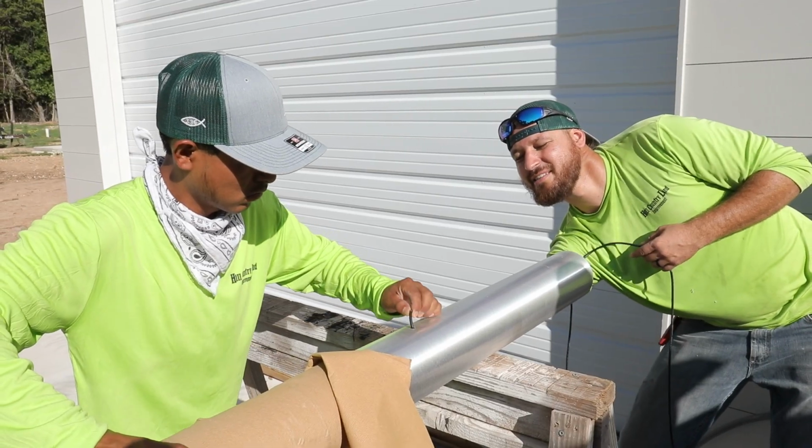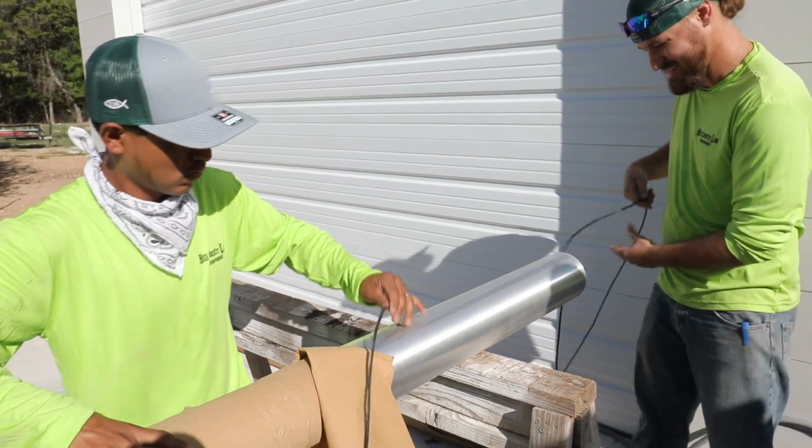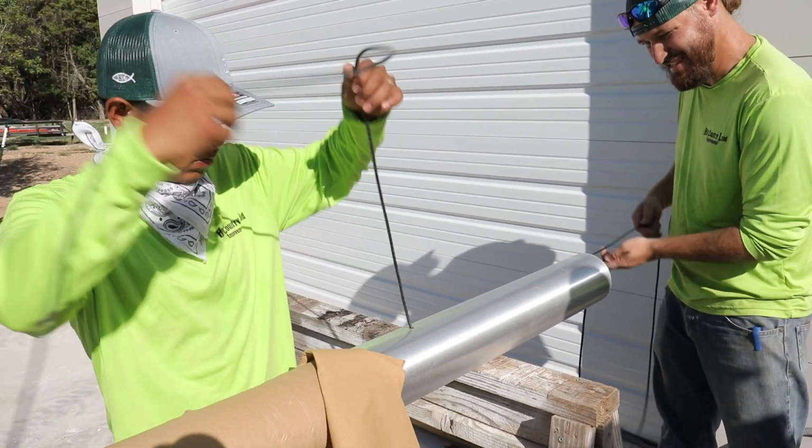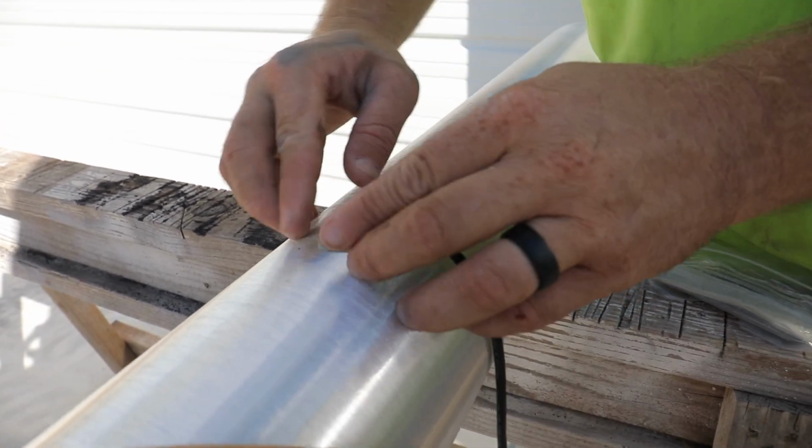Gently feed the low voltage cable back up the pole and through low voltage wire access hole drilled at the beginning of the process. Apply putty compound, not provided, around the low voltage wire at the access hole to the pole.